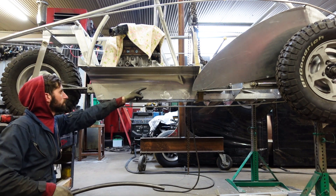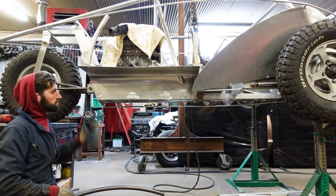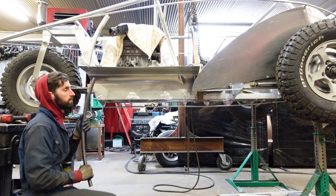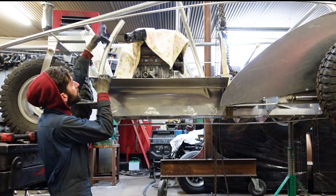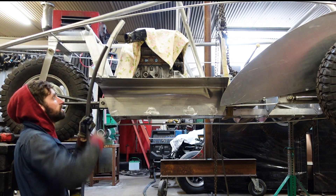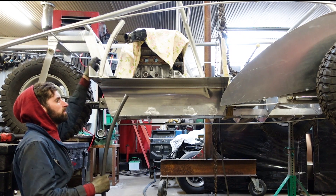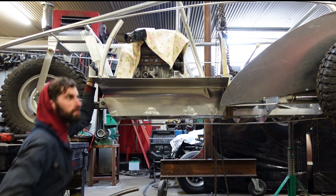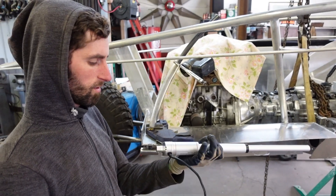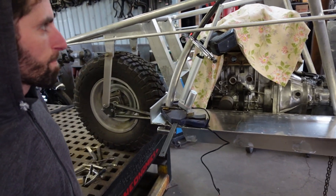I think I have to make the coupler on that end of the drive shaft so the propeller shaft is then on a pivot consistently. Then I can sort of see if there's going to be any binding when I hook this stuff up. I'm going to cut here somewhere, get this thing mounted in there, and then there's going to be a hydraulic cylinder or a 12-volt actuator to make this go up and down. I got this 12-volt articulating actuator that's going to connect to the steel part and be mounted here on the aluminum, and that'll slide.